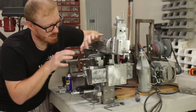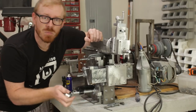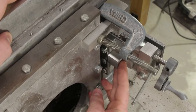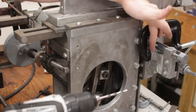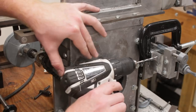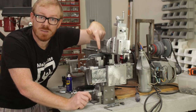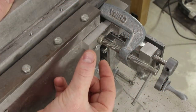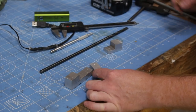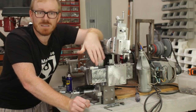I've got to mount the vertical lead screw on this side of the shaper and it consists of three castings. There's a top and a bottom bracket and then a tapped mounting block that attaches to the back of the cross slide support. To be able to drill this hole I had to remove a portion of the mounting brackets for the pinion gear drive train in the back of the shaper. So I'll take a piece of threaded rod, cut it to length, and then I'll use a bolt on the top along with a couple washers and a nut. I'm going to have to sand down the top a little bit more to make clearance for the bolt, using hardware I have on the shelf as opposed to trying to get a custom length coupling nut.